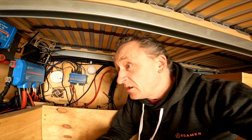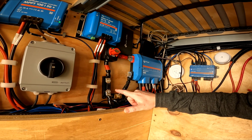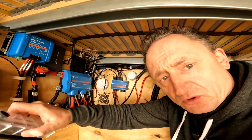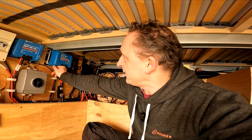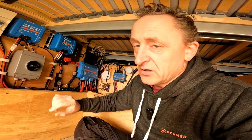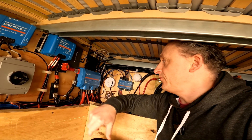Right, I'm now in the garage and here is our electric setup. There is our mega fuse which I'm going to take out — that's where we're going to put in the new T-fuse. The new T-fuse holder is substantially bigger but I'm sure it'll still fit. I'm going to turn the system off first so it'll be safe. I've turned off the connection to the front battery, I'll pull out the DC-to-DC — always take it out just to be safe — and I'm going to kill the solar, so now I've got nothing coming in from that.